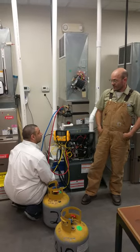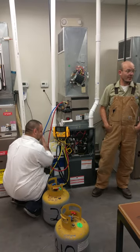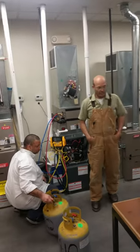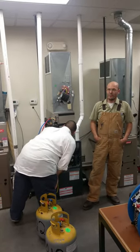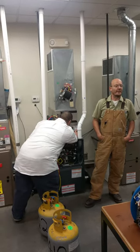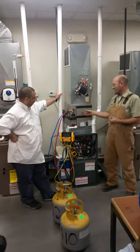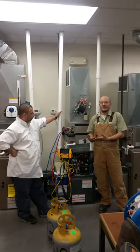The next thing you're going to do — we need to know what refrigerant we're dealing with, correct? We don't want to mix refrigerants, so we've got a jug that I hope is R22 and a jug that I hope is R410A. The inside model evaporator core can tell us — it's rated for R410A. You go out to the condenser. You can also look at the TXV — see if the TXV head is R410A rated and we can assume it's R410A.